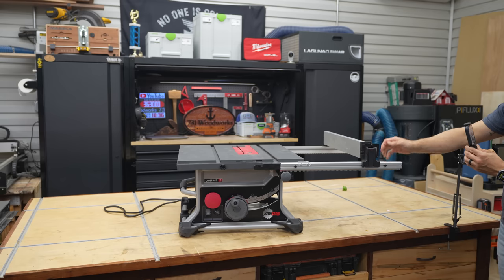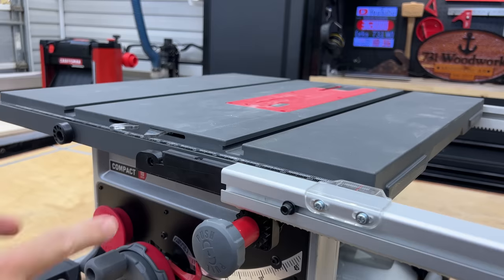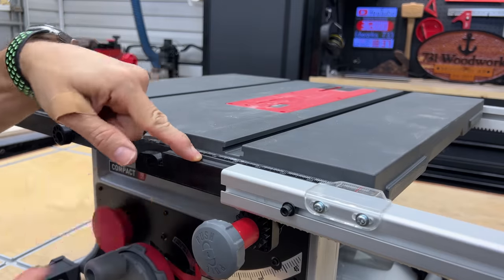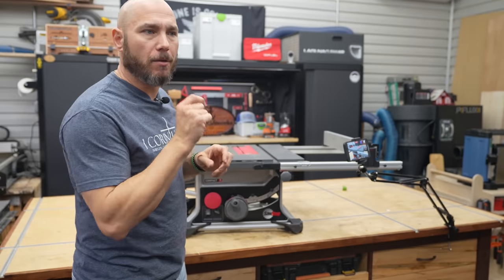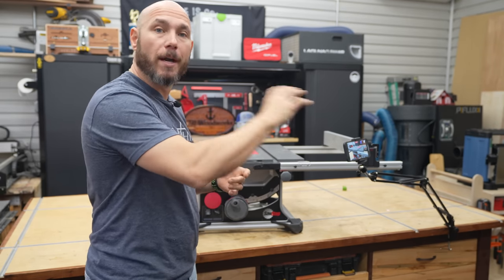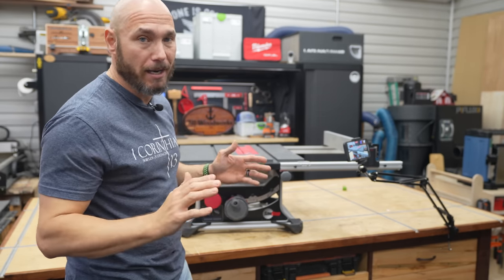You may see a little flexing, but that's actually the entire saw flexing, not the fence — the tabletop and all moving together, which is fine as long as everything moves together. Also, this piece in the middle on the front and back are basically two wedges. You loosen the bolt and slide those wedges apart, which creates another wedge inside the fence and tightens everything up. So you have a super snug fit all the way across, as far out as you can extend the fence. It works great now.